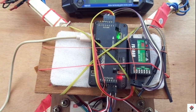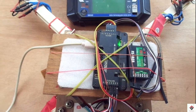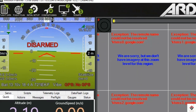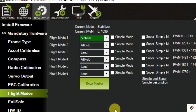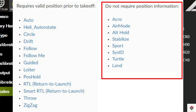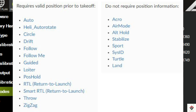Moving on to the solution, we have to just disable all the features which require GPS signal. So first go to Initial Setup, then Mandatory Hardware, and Flight Modes. From this table you can see these are the flight modes which can work even without GPS, but the other column needs GPS signal for their working. So make sure you have selected the modes which don't require GPS.